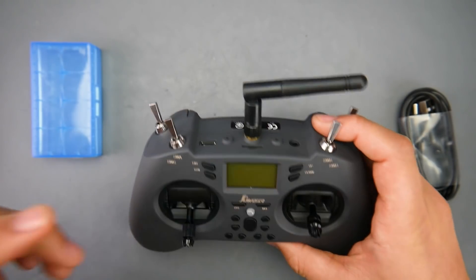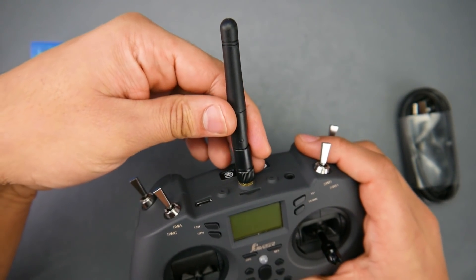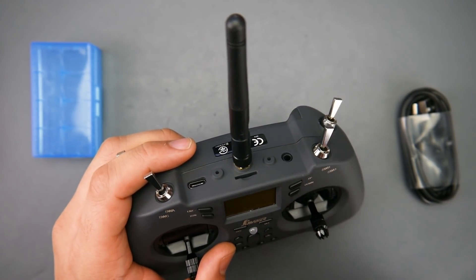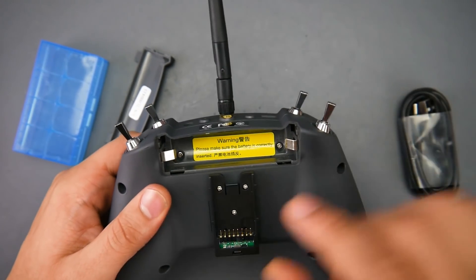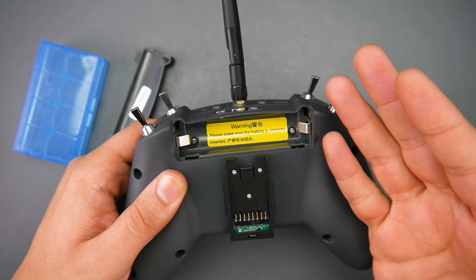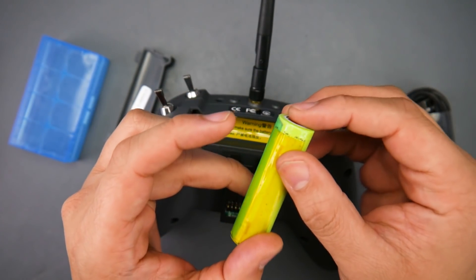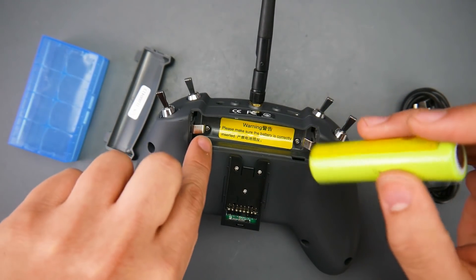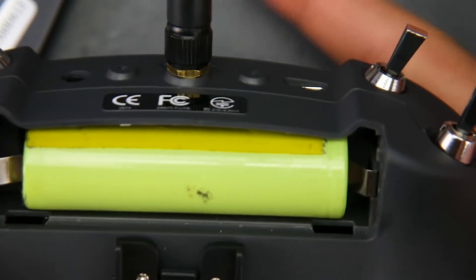Let's do the warnings first. Make sure you install the antenna before you boot this — there is no protection, and you will ruin the range. Also, it's very difficult to see which side is positive and which is negative on the battery. From the warning labels, there is no reverse polarity protection, so you can fry something if you install the battery backwards. If your 18650s are flat-top, you'll need to slightly extend the contacts for good grip. The positive is on the right side — just double check that and make sure you install it correctly.